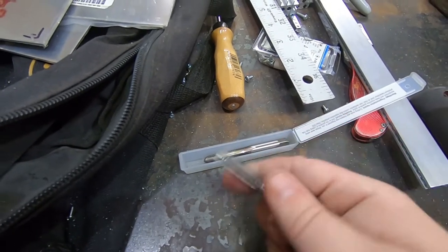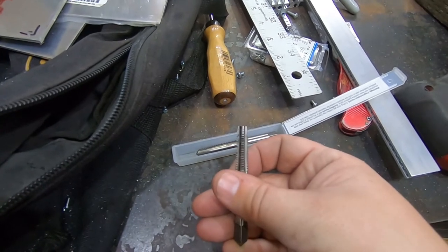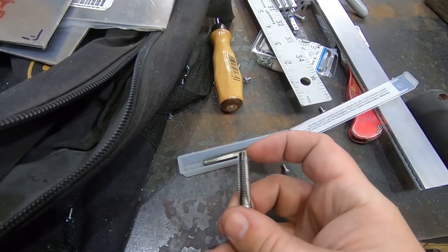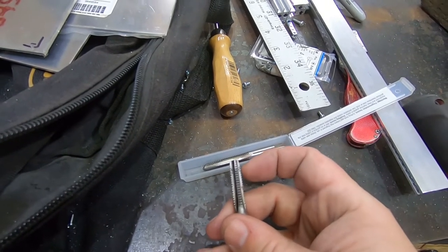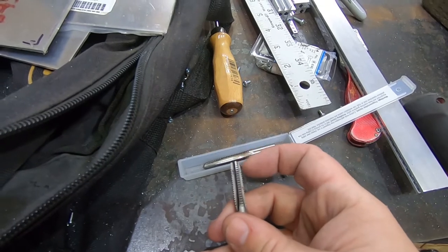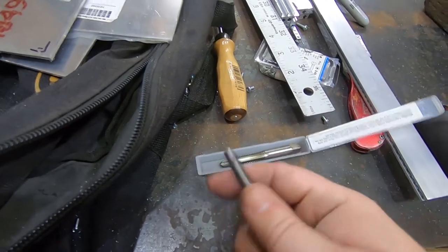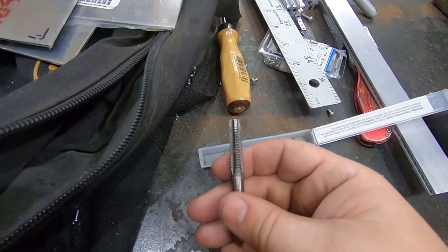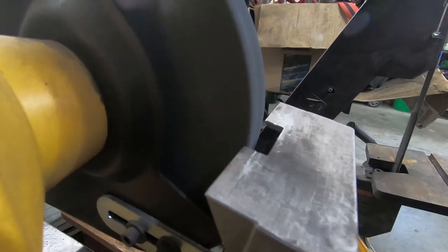But what I'm thinking is, this one is one I've been using, and it's been feeling a bit dull. It's reaching the end of its life, and there's this shiny new one. So what I'm going to do is grind off the first couple millimeters. So there's still a little bit of a taper, but not as much as here. So then I will tap as much as possible with the good one, and then follow up with this improvised bottoming tap. And we'll see how that goes.